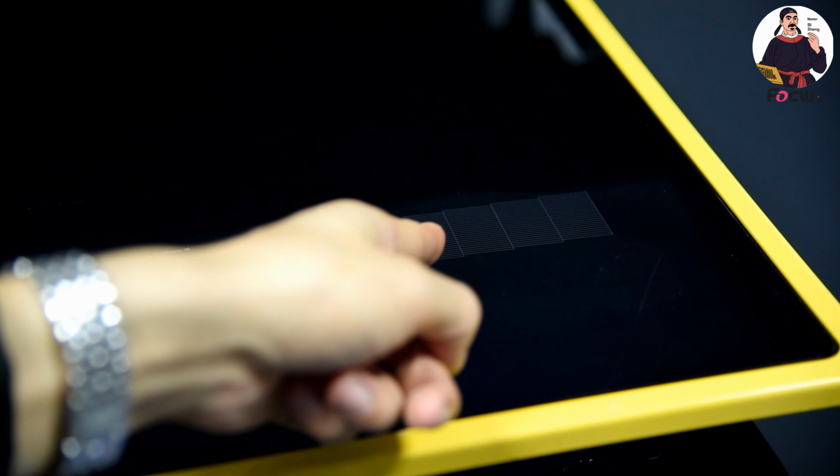Okay, after printing the white ink, we can see all the color channels are coming out. In total there are 8 channels: 1, 2, 3, 4, 5, 6, 7, 8, and you can see just a little bit of ink not coming out. So we get 99% of the ink coming out after we load the ink. If you cannot get a good result like this, you need to do the head cleaning again to be sure you get the white ink print head coming out well.